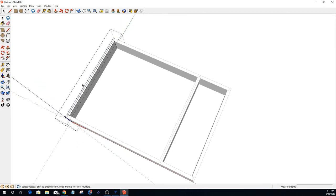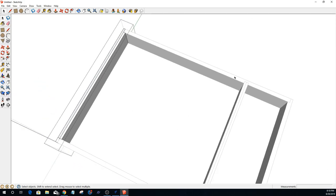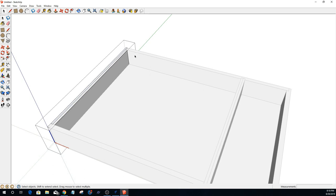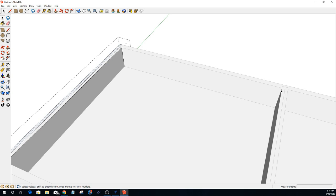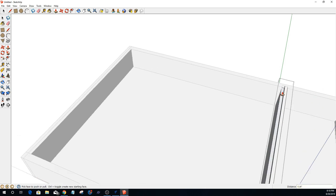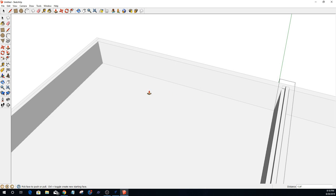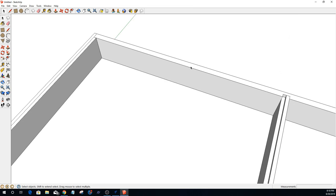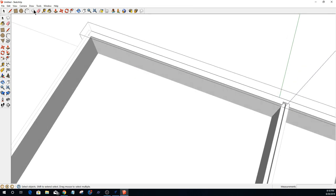Now, my lid, I'd like to have the edges of my lid rabbeted, because the CNC is going to do all this, so I can cut all these rabbets pretty easily. But on this part here, we're going to push this down 0.25 inches. And I would like all the way around a rabbet to be 0.25 inches all the way around. So let's go ahead and get this line drawn in